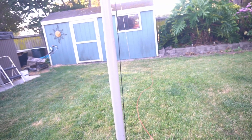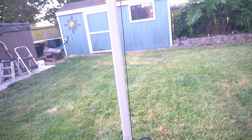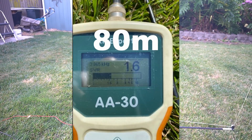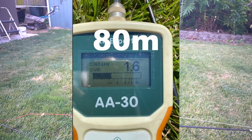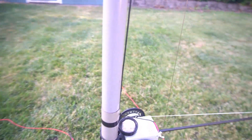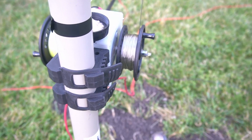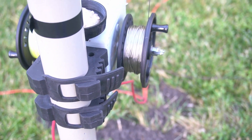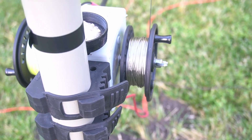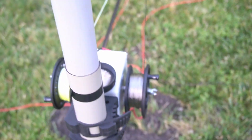For 80 meters, I've got enough wire on here — Colin says it'll do up to 2 meters as the highest frequency. I may have to do 80 as an inverted L because the pole isn't quite tall enough; I haven't tried it yet. It depends on the linear loading. The wire is stainless steel downrigger wire — it's pretty pliable and doesn't want to kink up, though if there's not enough tension on the reels and it spins, you may have to redo it slightly.